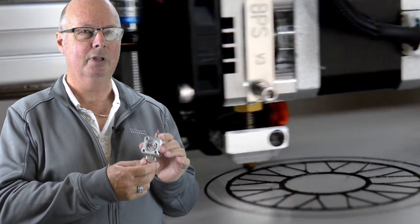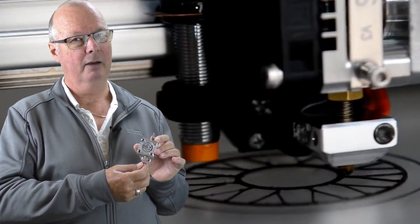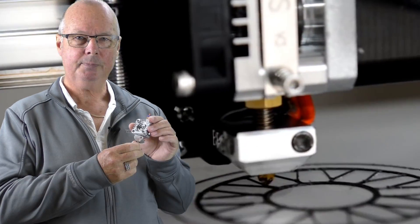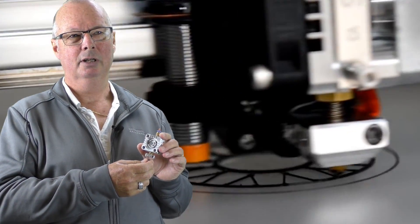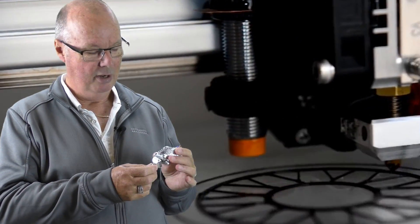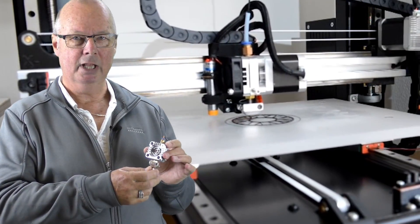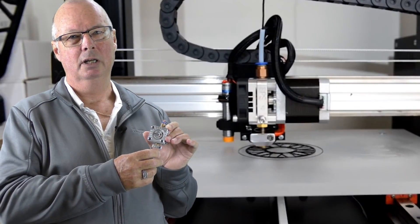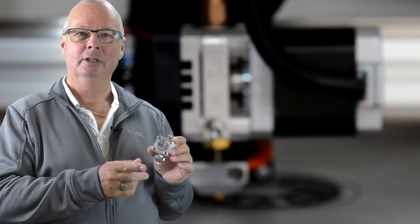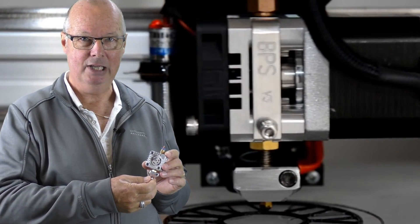It's claimed this will print flexible filament at up to 200 millimeters per second. I haven't tried that, however I have put TPE flexible filament through mine and had it printing at 66 millimeters per second — and it printed like PLA. It was absolutely brilliant. No other changes to my printer except for temperature. Printed smoothly with no clogs, no jams, no filament poking out the sides.